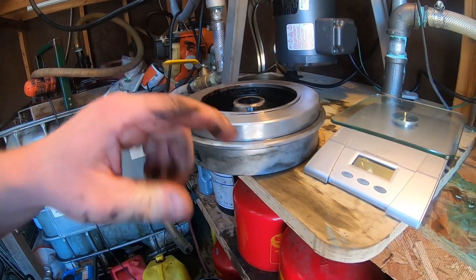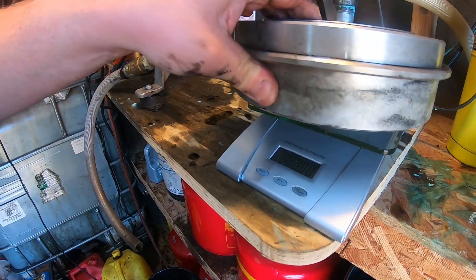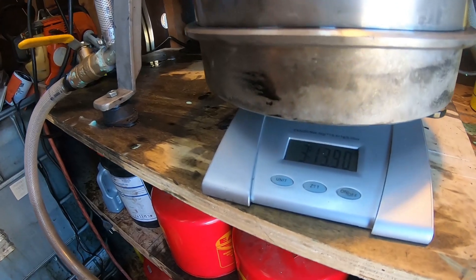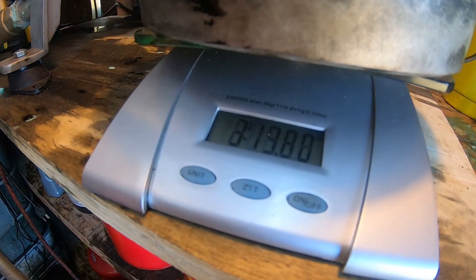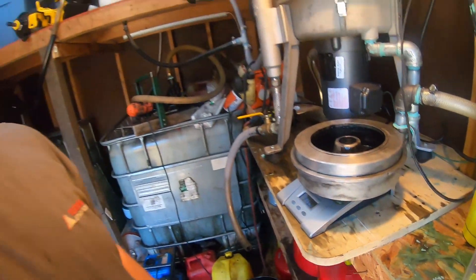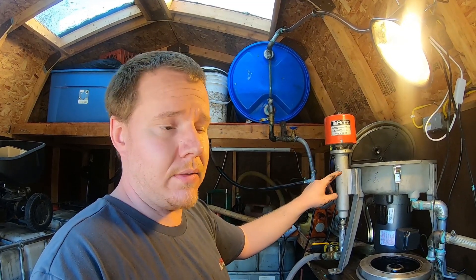We'll come back out, get weights on the rotor on the centrifuge, and run it through to see how it does. The bucket has been sitting an hour and a half to two hours now, so the diesel fuel has been in there for that long. Hopefully it will have blended in a little bit and is doing its job. The rotor is not spotless but it doesn't need to be since we're doing a before and after weight. We are at three pounds 13.9 ounces. I'm going to get the rotor put back into place, start this up, let the heater preheat to roughly 200 degrees, and start it running.